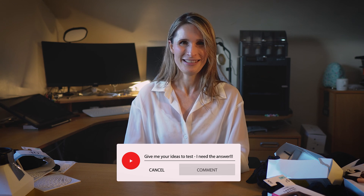This is a cool effect to observe. I've got a feeling this is linked to the angling of the airflow with the twist into a vortex pattern, much like the Dyson does, whereas the straight grills would splay the air outwards towards the edges and create a lot of turbulence. I'd love to hear your thoughts on this and can run further tests. I'm thinking it could be cool to run some smoke tests to actually see the turbulence. Regardless, there was no real decision here - the larger grill with a 30 degree twist was the winner by a mile, so that's the approach I'm going with.